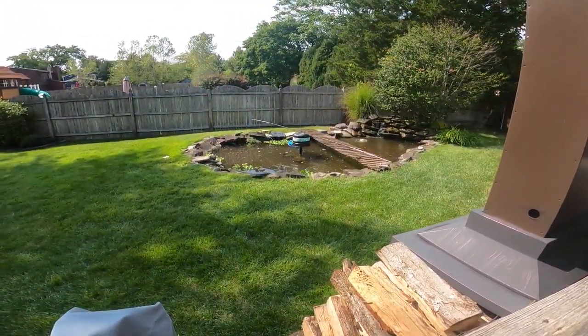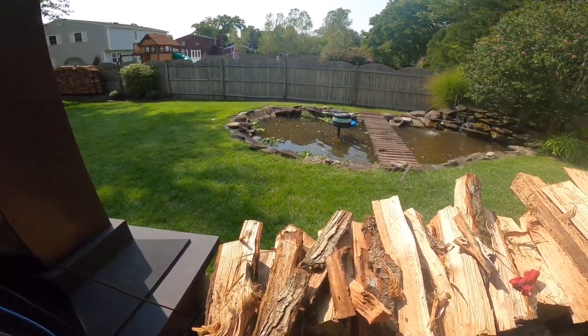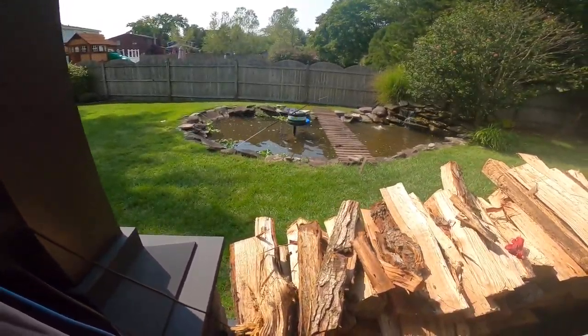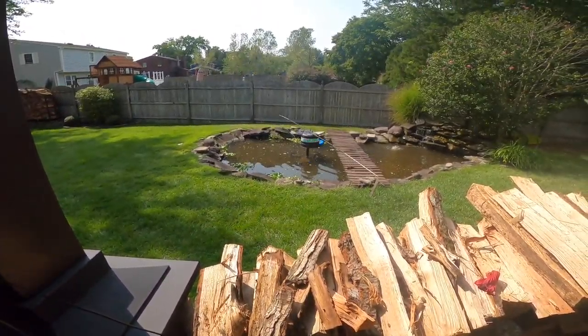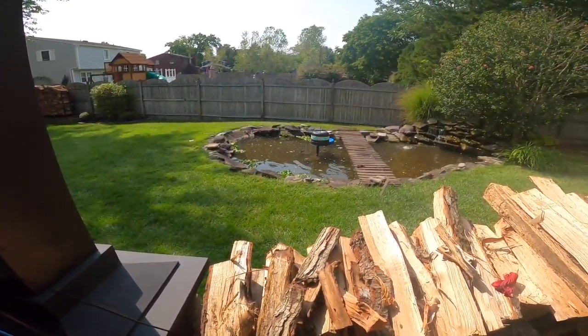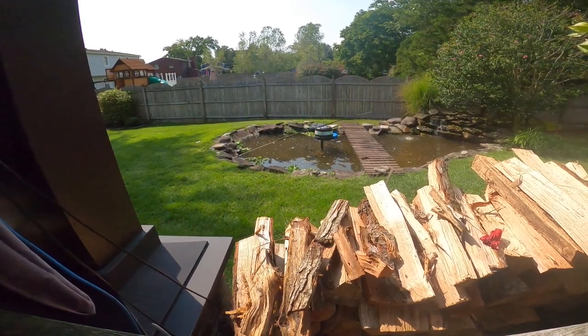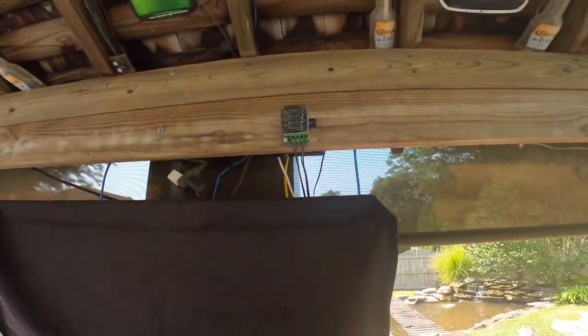Just an update — Dark Helmet is up and running. I found that the motor had water intrusion and virtually no lubricant. On the new motor I lubricated it, checked that there is a seal, and added an upper rubber O-ring to deflect water at the very top of the shaft to keep water from ingressing and ruining the bearing. Now there is plenty of heavy-duty grease in there.